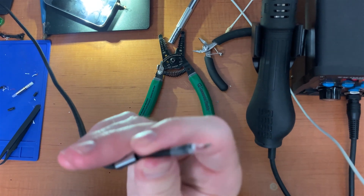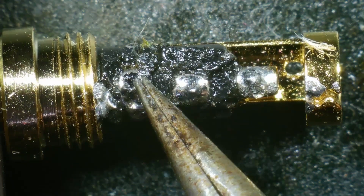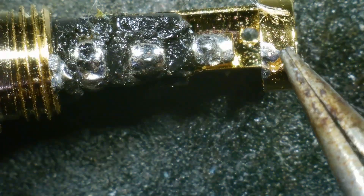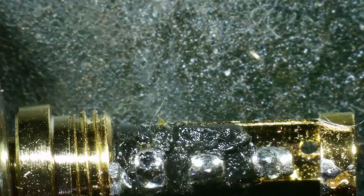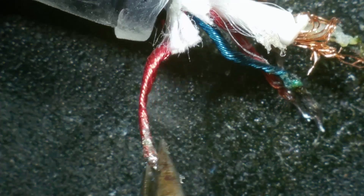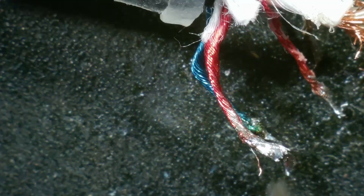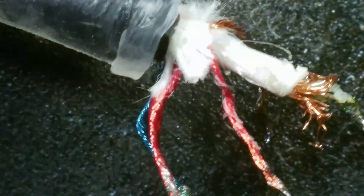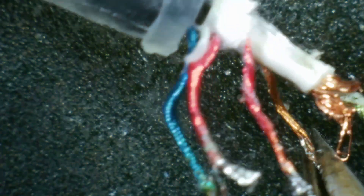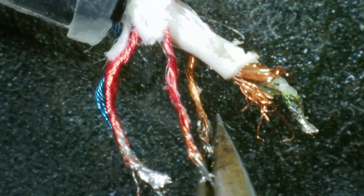So I'm getting on that right now — it is a really tight squeeze, but it's on. Now let's get this thing underneath the microscope and get it all soldered together. What I discovered is this little guy right here is ground, this is the right, and this is the left, and this is the microphone. My friend who asked me to repair this has said do not worry about the microphone — he never uses it. So that saves me the trouble of trying to get that wired together. I have confirmed 100% that this one right here is in fact the right, and this one right here is definitely the left. I discovered that the two braided copper wires are in fact both the exact same wire, which is very frustrating. But this one up here is specifically the ground for the left headphone, while these right here are for the right.